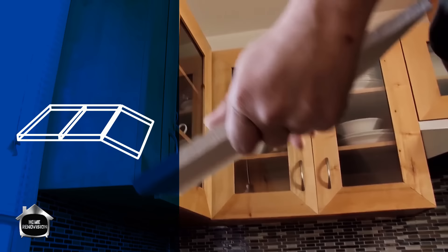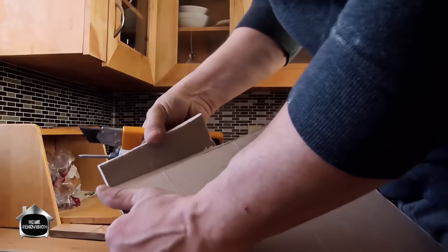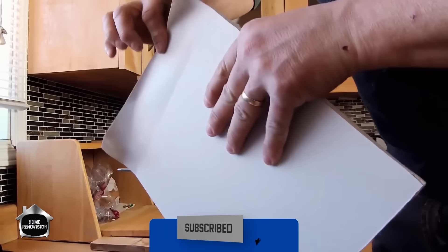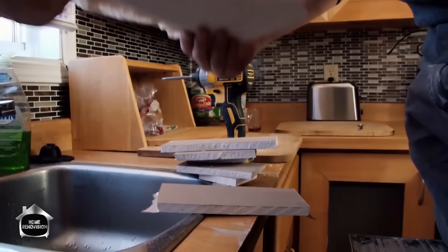This is going to seem ridiculous, but you just break it on that line, then using your fingers you put pressure on the drywall and peel it off the paper from the back side. This paper will serve as the tape — it's thinner than traditional drywall tape and it's already attached to the patch, so it reduces the amount of time the repair will take. Strip off any extra so it fits inside the hole.